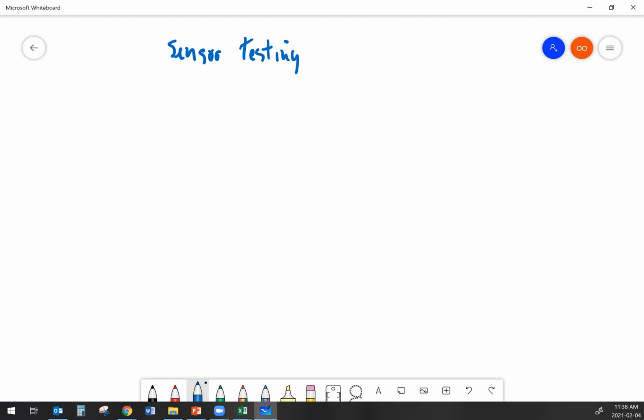The types of problems that we're typically going to encounter with sensors are either a problem inside the sensor, a problem in the harness, or, least likely, a problem in the controller. Any of those faults, though, usually generate different types of fault codes. And two of the most common fault codes that you're going to find would be an out-of-range high and an out-of-range low fault code.